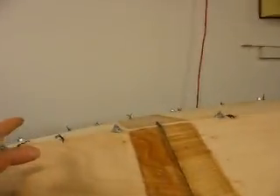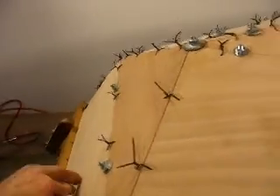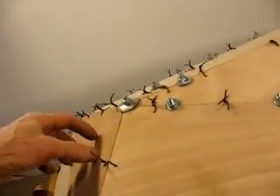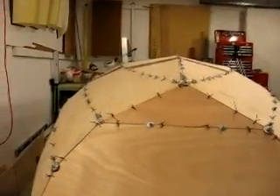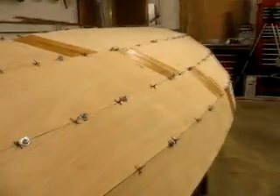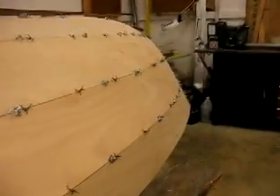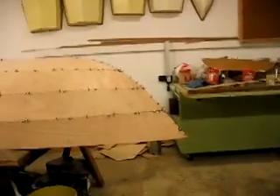On the bottom, up in here, there's going to be a pretty good-sized skeg coming back down to about this height, and then it'll angle in at the same angle as the transom comes up — the skeg will match it. The rudder will attach there; I'm probably going to put the lower gudgeon on this big bulky piece down here and the upper one about halfway up. Let me get a curvature shot back in here — step back and look at that. That is so pretty.